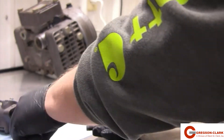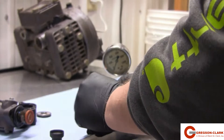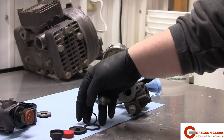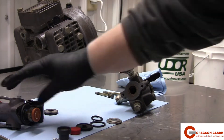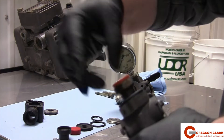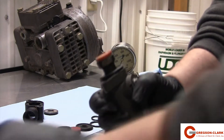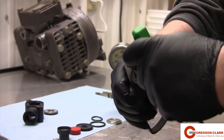To rebuild, you will need part number 8701.10. This is the entire rebuild assembly for this regulator. Start the rebuild process by removing the old urethane poppet from the cup assembly. The urethane poppet typically gets worn out, causing pressure to reduce over time.